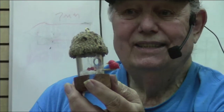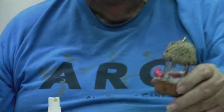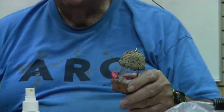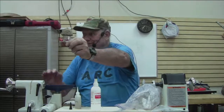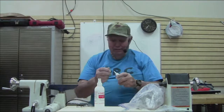So, how did you cut the tubing? Hacksaw? Bandsaw, with 16 teeth per inch. I buy it in 4 foot strips and measure it off in 2 inches. And zoom, zoom, zoom. And there's a nesting bird. And with that, ladies and gentlemen, that's it.